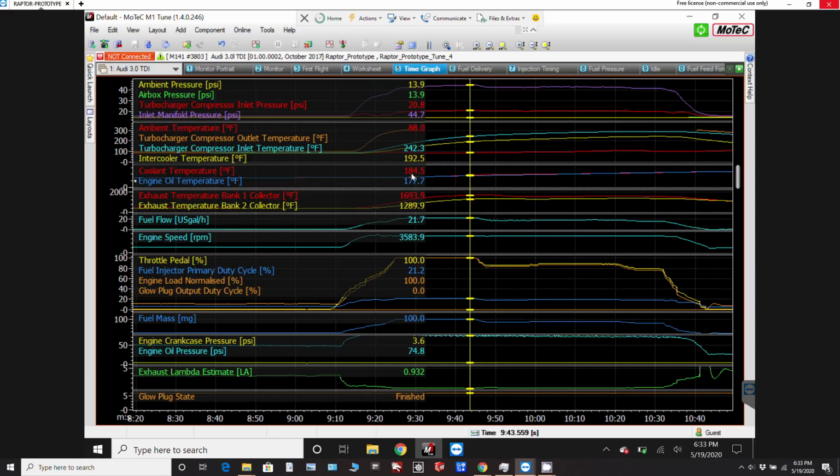so you can kind of see, when you see the spread where the coolant temperature increases more than the engine oil temp, it means the heads are where the extra temperature is coming from, and then that obviously shows up here when you've got the EGTs running higher. So anyway, that's what I was watching next after I stabilized the EGTs by pulling the throttle back to the high 80s.